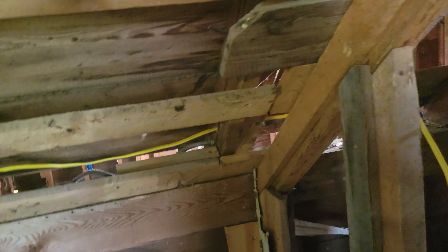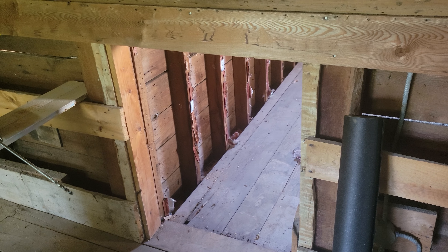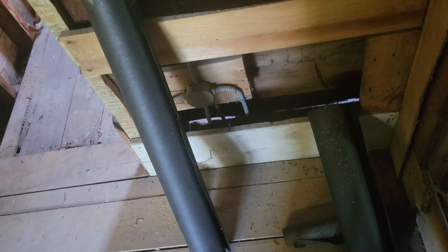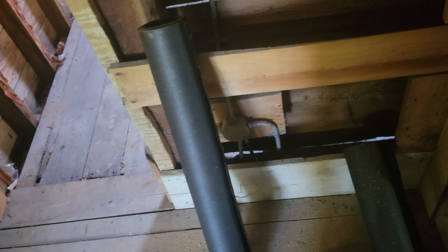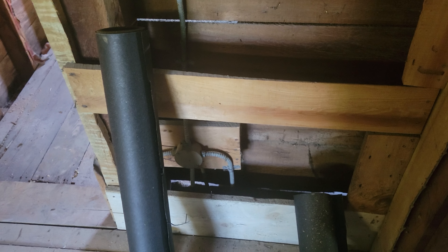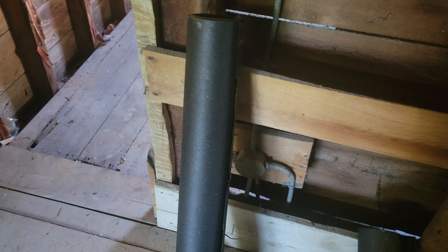This took some thinking because I didn't want to have any wire exposed through one of the entrances to the secret room — one of the hobbit doors. So I ended up drilling a hole in a couple of the rafters to pass the wire through. This is the corner where the old wire comes, and as near as I can figure out, the old wire loops above the front door somehow, loops all the way across the ceiling, comes to this where it distributes power below it, and ultimately gets the power to the sump pump. They just spliced another spot on there and the sump pump's ready to go. The sump pump probably needs to be on its own circuit — we'll get there.